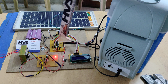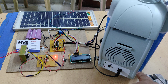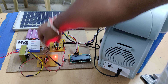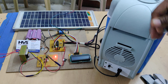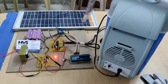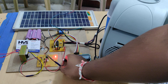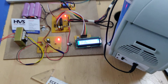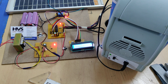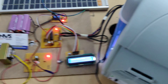When we turn this on, the microcontroller starts reading input from the temperature sensor, the DS18B20, placed inside the box. The temperature value is continuously displayed on the LCD screen. If the temperature falls below 20 degrees centigrade, this relay will automatically switch off in cooling mode. We are using an electromagnetic relay to control the power supply to the peltier plate along with the fan. When turned on, a welcome message is displayed first, then the temperature is shown. Currently the temperature is normal, so the electromagnetic relay is switched on, and we can place it in cool mode.